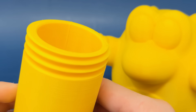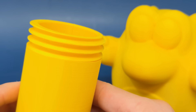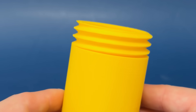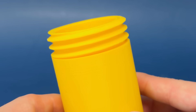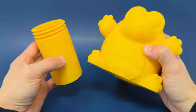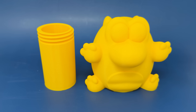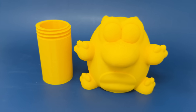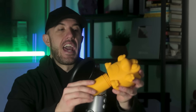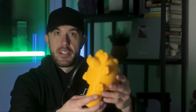While this design includes threads, you don't necessarily need them — you can design it as a press fit where the layers interlock and the insert won't come back out. No glue is necessary as long as tolerances are good, but it's recommended to design in a retaining feature like threads for reliability. This way, the part can be shipped dry and your users fill it with sand or gravel to add weight, or you can pre-fill it and ship it fully assembled.